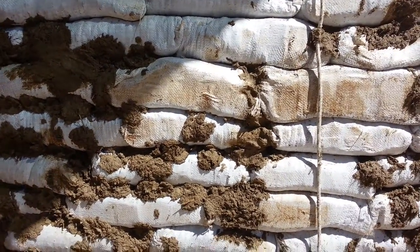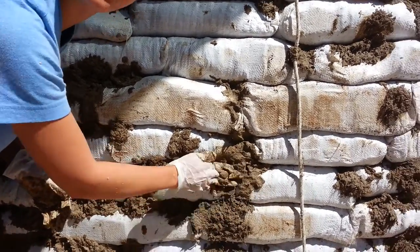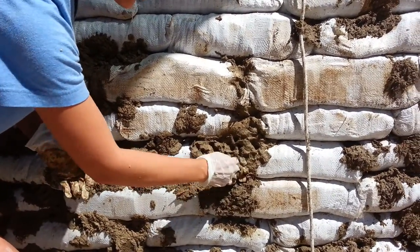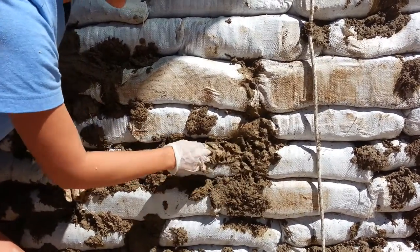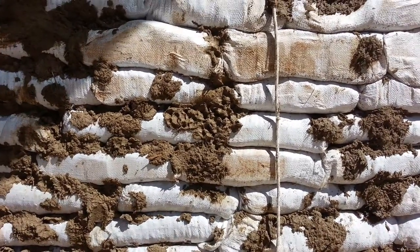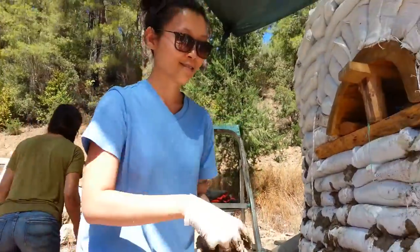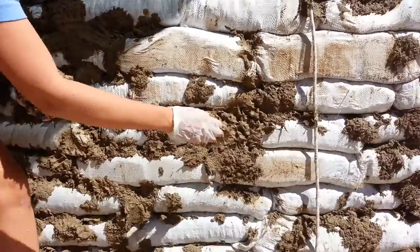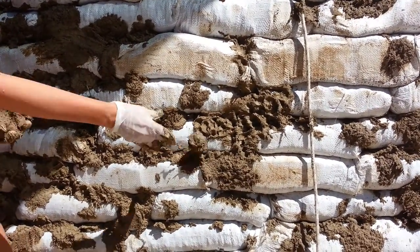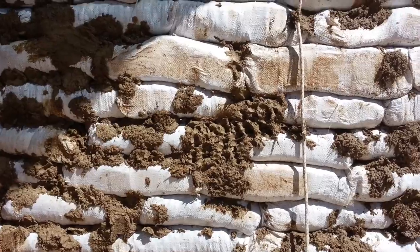It's a bit sunnier so people can see. Smear it on? No, you don't — throw it on and make some holes in it. Keep throwing it on, because if you throw it on it sticks better. She's just getting some more plaster now. Here she comes with the plaster. You see that? She's dimpling it. And why do we dimple it? To get that extra grip for the third layer. Perfect, she's on it.